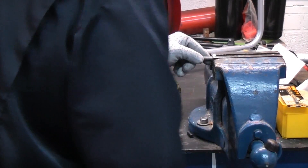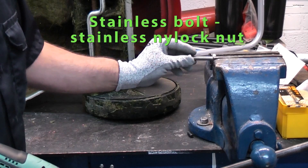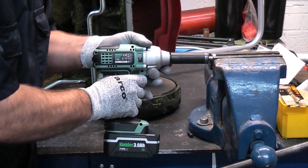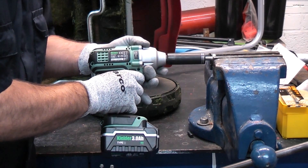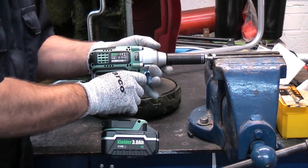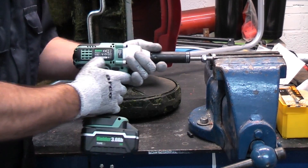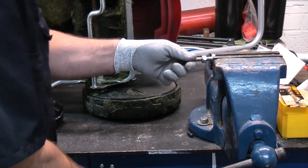I'm now going to put this set screw in the vise and then use a stainless steel nylock nut, and I'm just going to run that up and down the thread a couple of times. Already you'll see that it has galled — you can hear the hammer on the impact wrench. That nut is now seized completely onto that bolt.